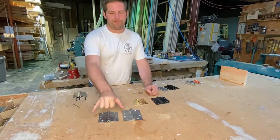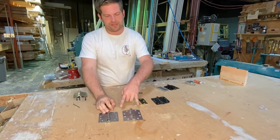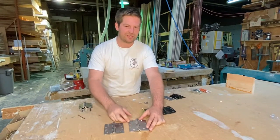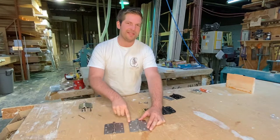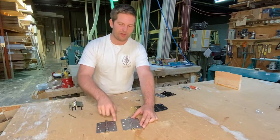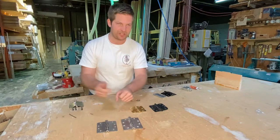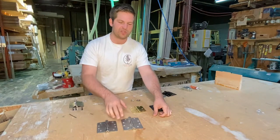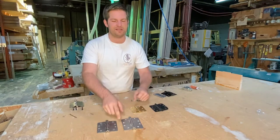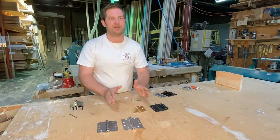This is our standard 4x4 1¾ exterior door hinge. This is 4x4½ inches, and this is meant for commercial applications. In the woodworking world, we don't like this hinge because it has sharp corners on it. We use router bits to carve out all of our plates, and with corners we have to use a second jig to stamp it out, then chisel the sharp corners out. So it's an extra step for us, so we don't like that, but metal guys really like it because their presses create sharp corners. So again, we can do it, but each industry is going to have their own favorite